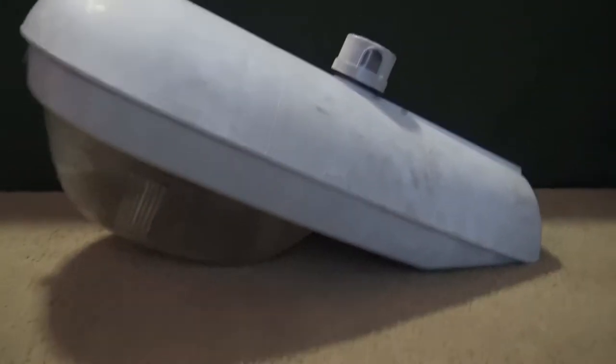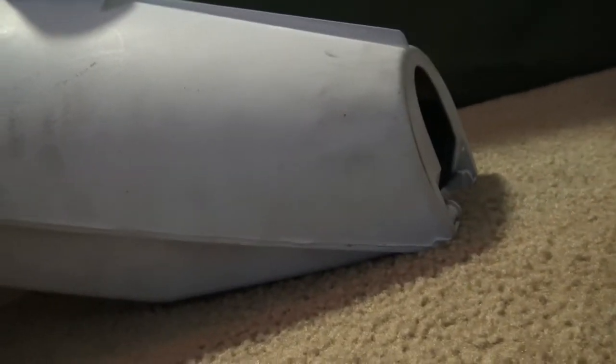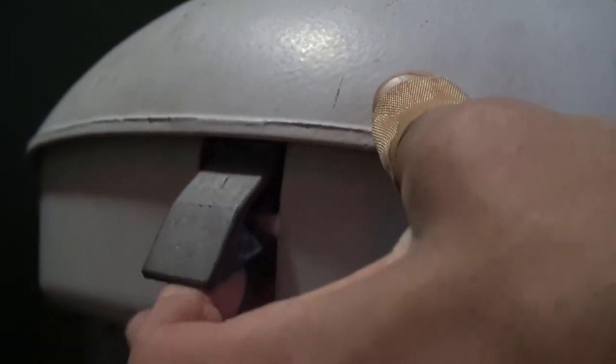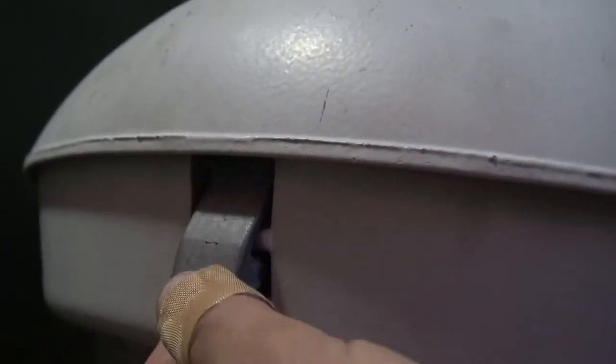Let me go ahead and lift the camera up so we can take a closer look at it. This version is a little bit older — this is a 1996 Cooper OVD. My HPS one is from 2010, so it's relatively new still. There are some minor differences with this Cooper OVD. One is the latch on the front to open up the fixture's door — there's sort of a barn-style latch, kind of like the older Westinghouse fixtures, that you pull up to open the door.